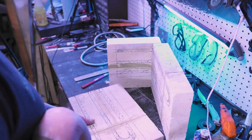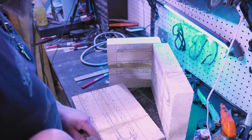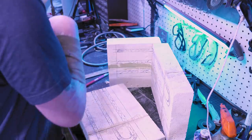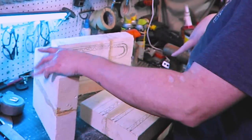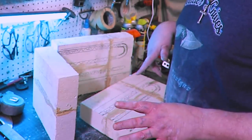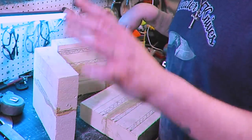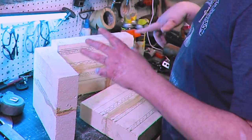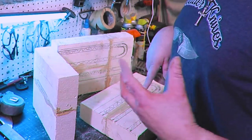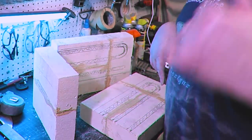Now what I think I'm going to do is put a 1/4 inch bit in the drill press, go down 1/2 inch, cut this one lane, cut this out and come out here. And then do it on all three, and then I'll move up to 1/2 inch. So let's get over to the drill press. Since there's so much dust in that, I'm just going to do a time lapse. If you want to watch my older video where I rebuilt my other heat treat oven, I do it all in slow motion and go through the motions there. I just need to concentrate on what I'm doing because I've never done half inch. And also, since I'm just getting over being sick, I'm going to wear a respirator because all this dust isn't that good.